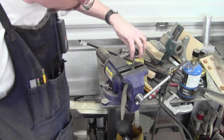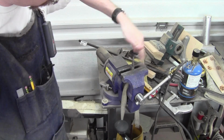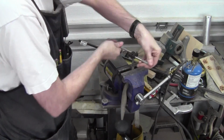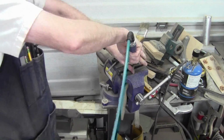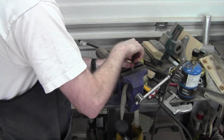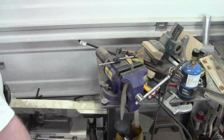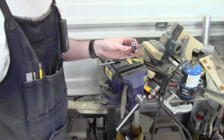Alright, got her tap, blew out the hole a little, greased it up nicely. Let's get it to start first. Send it down. And the usual tapping process that one must endure. Okay, do the same thing to the second one. Really quickly, there's a burr on that I want to chamfer out, so actually I'll do that on the mill later. Okay, second verse, same as the first.